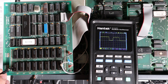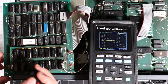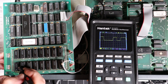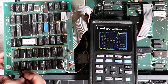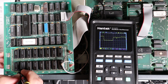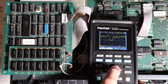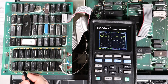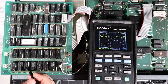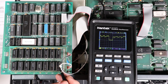Next, I'll test each of the 8 address lines — these are shared across every chip so I'm just going to test one for starters. A0, A1, and A2 all look good. A6 seems okay. A3, A4 — fine. A5? Hold up. A7 is okay, but A5 looks weird. Let me pause that and zoom out — yeah, that doesn't look right. Just for good measure, let me test A5 on each of the RAM chips. The line is shared so I'm not going to be able to isolate the problem this way — it looks bad everywhere. I wonder if it's a single RAM module causing this, or if it's an LS logic chip that's gone bad.